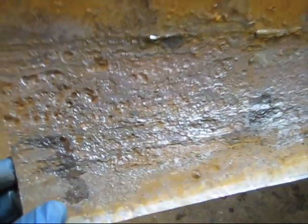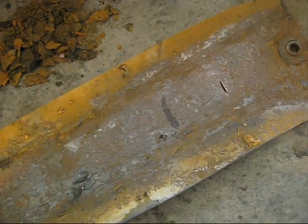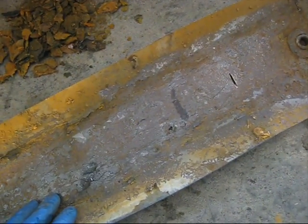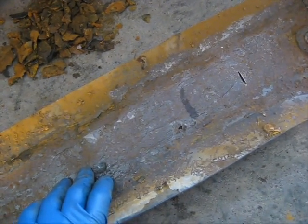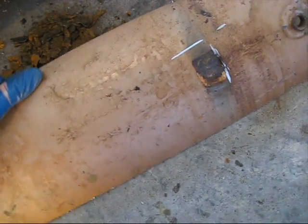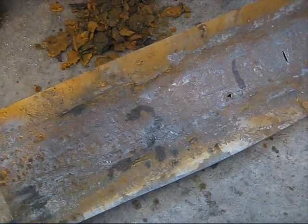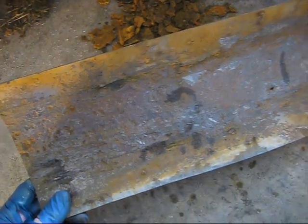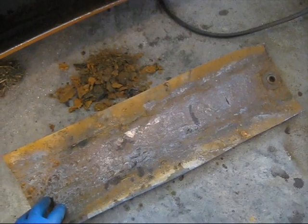So this is what happens when you don't drain your air compressor. Whether it forms a pinhole leak that seems like no big deal, or it explodes and possibly kills somebody, there's really no way to know. The takeaway from this is: drain your air compressor, and drain it regularly. I try to drain mine on a regular basis because I don't want this to happen. Because if you don't, you could be sitting on a ticking time bomb.